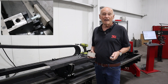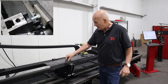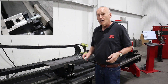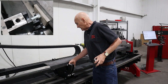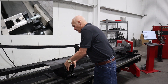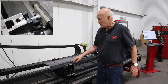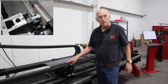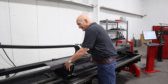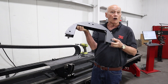It's Sunday afternoon, there's nobody here, and I can't find that little adapter plate, so I've gone ahead and just got a piece of half-inch by two-and-a-half-inch cold rolled cut three inches long and I'm going to drop it in right there. Rest assured there is a prettier piece that we supply. All I have to do is take my hex bolt, place it into the provided hole, drop my plate in — just snug it up a little bit, push it back, snug it up — and you can see it's going to be pressing much higher. The real clamp plate will actually be pressing doggone near the top. Now let's go ahead and place the top half on. The socket cap screws are still in the adapter plate — there's no real reason to remove them.